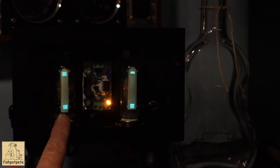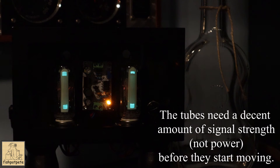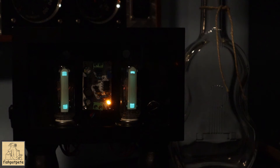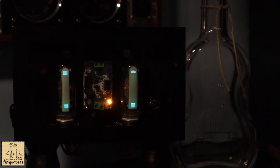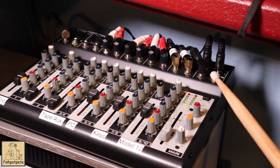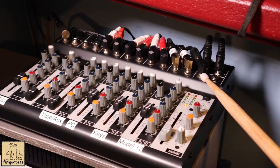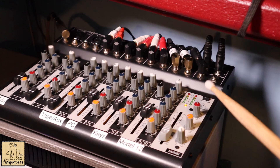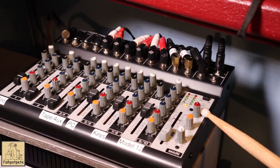This is actually stereo, so you've got a right and left channel. I'm running it as mono because I had a problem getting a good source to power these, and if you're dealing with different sources of music or sound, you'll get different input levels. What I've done is hooked it up to my mixer — I've hooked the output from my send channel to this. It's a mono signal coming out, so I used a mono to stereo adapter. That allows me to adjust the gain level, the output level, to that auxiliary send, which is what sends signal to the tubes.